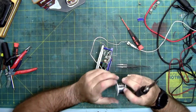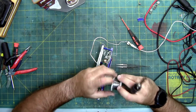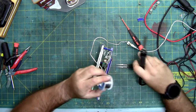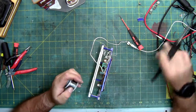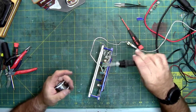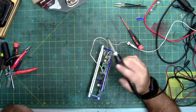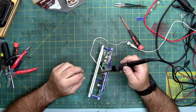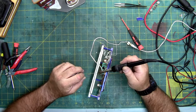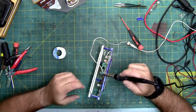And I'm going to do this while it's powered on so I can make sure that the lights work. And I'm also going to do this kind of improperly as far as soldering goes. In soldering, you're supposed to tin the tip and then solder your joint. Well, I can't get in there to run the solder. So I'm going to bring the solder to it by just soldering on the tip and then going down and touching. It's the improper way, but due to the spacing, I'm going to have to do it improperly. It should still give me the same effect, though.